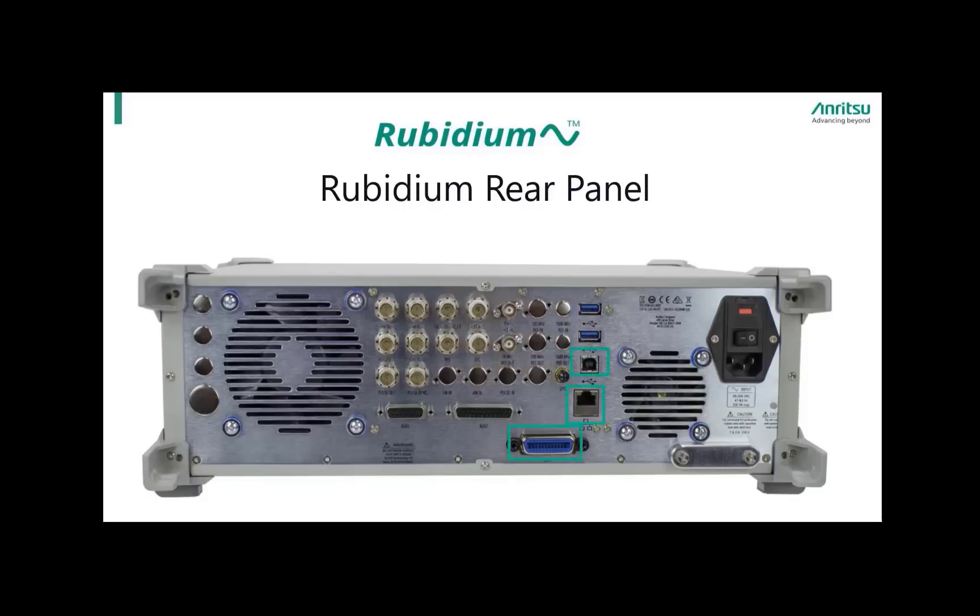For users that want to access Rubidium for remote automation, there is a USB 2.0 Type-B port, an RJ45 port, and a 24 pin IEEE 488 GPIB connector. Users can use these various ports to program Rubidium using SCPI or native commands. Additionally, Rubidium has an IVI-C driver and LabVIEW support. In the final section of the Rubidium back panel, there is an AC input connector. For users that require removable memory for security purposes, Rubidium accepts an SDIO memory card. There is a solid rear plate designed to mechanically secure the SDIO memory card.